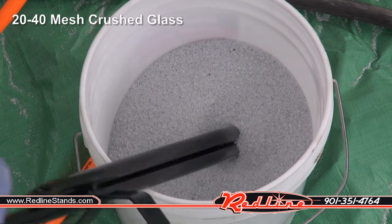All right, so the beach sand did really well at removing a lot of paint very, very quickly, and I liked that. It removed rust, but not as well as the garnet, to be honest with you. It did remove powder coating up in here. However, I started experiencing a problem, and I flipped it over and tried to start doing a new section in here, and I was having a problem getting the beach sand to just flow steadily.